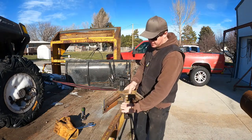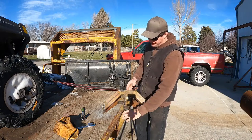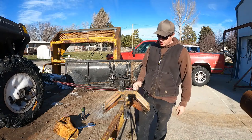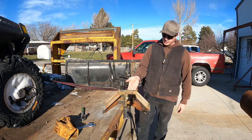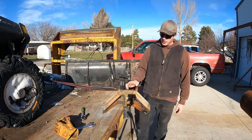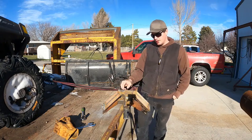And that's right here on this face. It's limited at this hinge point, and that's just because this surface contacts this lower surface. So what I'm going to do is come in and cut this lower corner off and put a plate on there — just do a bevel. I'll cut an inch up on this side and a half inch in on the bottom side, and then I'll put a new plate in there.